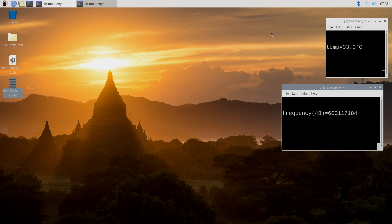In order to overclock the Raspberry Pi, we need to access the config.txt on the SD card. You can actually shut the Raspberry Pi down, place it in a PC, and modify it from there — that's one way I usually do it. But we can also do it all on the Raspberry Pi. Now if for some reason your Raspberry Pi does not boot up after we add these overclocked lines, you can always take the SD card out of the Pi and modify it on a Windows PC using Notepad++. I'll leave a link in the description, and you can check out my last overclocking video where I showed exactly how to do that. But for this one, we're going to do it all on the Raspberry Pi.